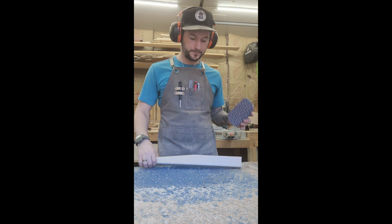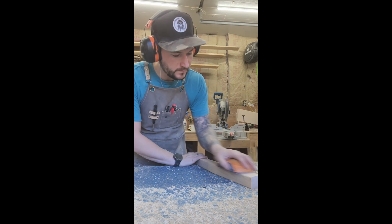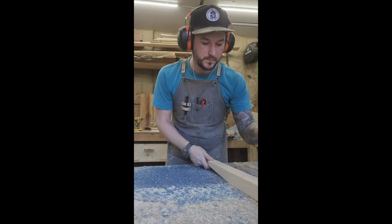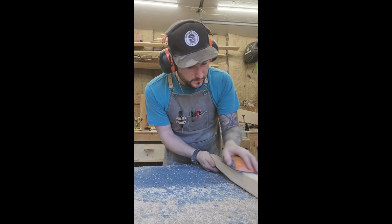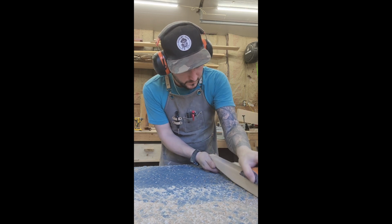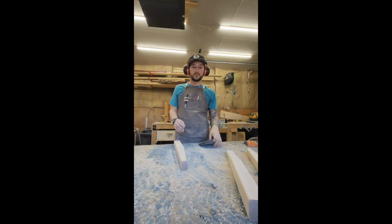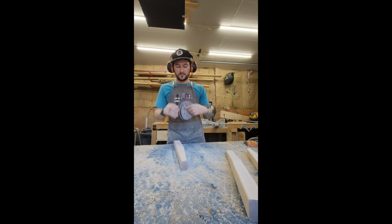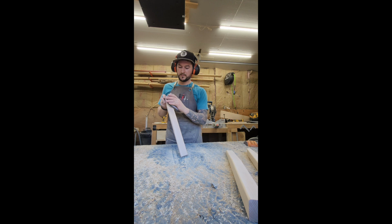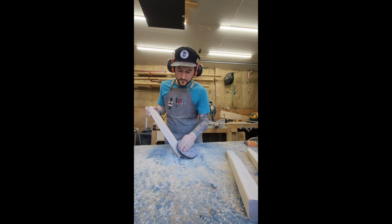Now to sand the legs. So there were saw marks from when I cut it. Obviously, I had to hand sand it. So this took a little while, wasn't too bad. Just time consuming. I went through the same grit, making sure that they were smooth, no saw marks. The round overs held their shape. Then had a soft pad that I took just to smooth over those round overs.